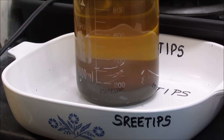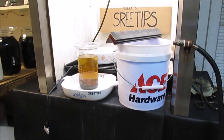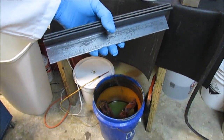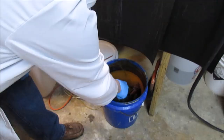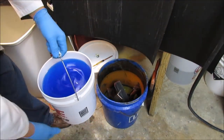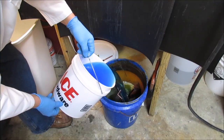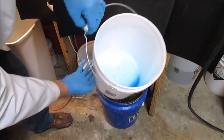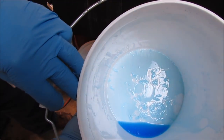I've allowed the silver to settle overnight. Now I'm going to start rinsing the silver out. Before I do that I want to take care of the waste — I'm going to put these pieces of iron into my waste treatment bucket and pour the waste down inside so it can be processed for proper disposal. This is just copper in solution — when I pour it in that bucket the copper will cement out onto the iron forming copper metal, and the iron will go into solution. There's a little bit of silver chloride left in there — I'll rinse that out and process it separately, though it's probably less than a tenth of a gram of silver.